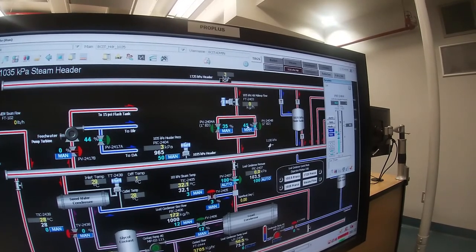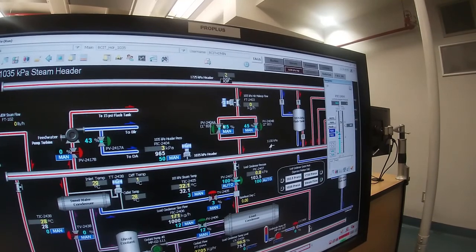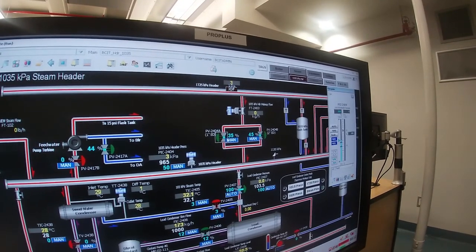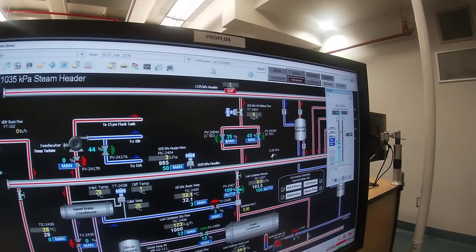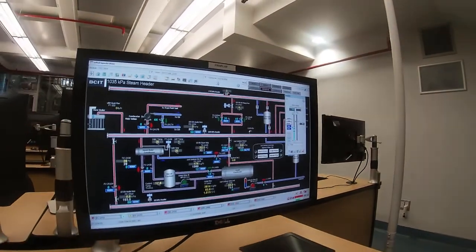Neither one of these valves has a whisper trim in it. They just have straight equal percent. And we intentionally did this to prove that noise actually is created from about 70% travel up to 100% travel. There's very little noise down at the bottom. All the rest of our valves are all whisper trims.